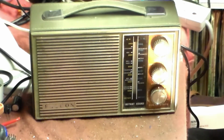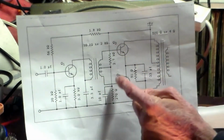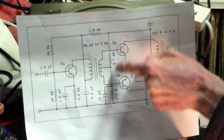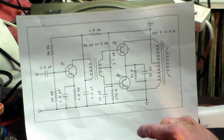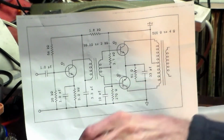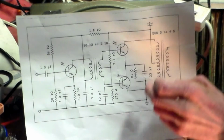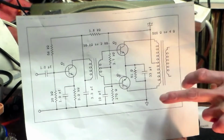I wonder if I've got the circuit here again. Not sure. Hang on. I did have. Here we are, right. So, see from there, the right way up. I've done it by changing the resistors in the set to those dot values there, and also taking off the two transistors that were germanium and using silicon, which get rid of the noise by reducing the gain slightly, and of course that's okay. So that is one thing.